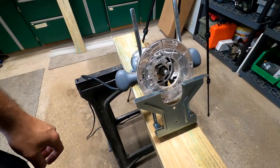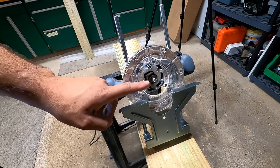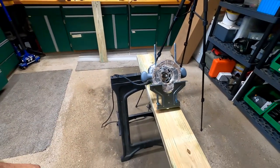If you put it through the center of the track, once you drive your boat on the trailer, it's going to completely cover the light. You'll still get some residual effect from it, but having it on the outer edge like that, it's basically going to be like an underglow kit for your boat. So we're going to get the router track out. Like I said, it's a half inch router bit set a quarter inch deep on a 1 inch offset. Here's the router. So 1 inch offset, half inch router bit, quarter inch depth. We're going to go ahead and router out all these tracks.